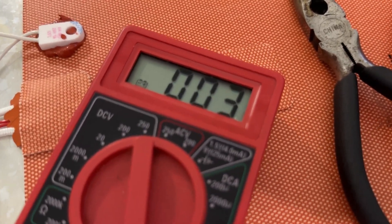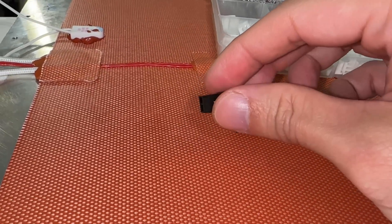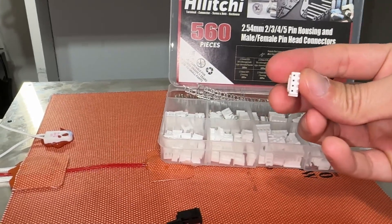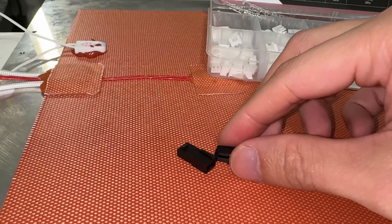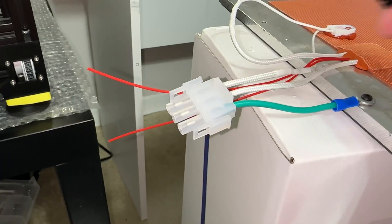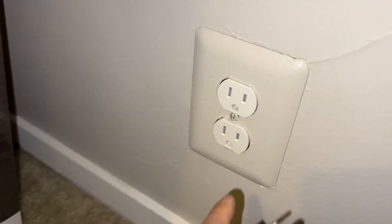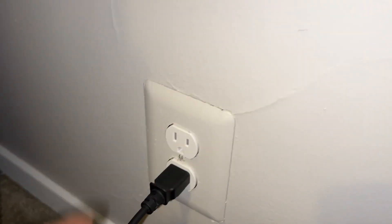For the bed thermistor wires, I will use a microfit connector. Some consider these optional since popular control boards use cheaper JST style connectors. However, the microfits have a better build quality and a higher 5 amp rating. They are also used for inline connections as there is no JST equivalent in the kit, unless you solder. If you don't know which connector to use, the female plug provides power to the male plug, like the one attached to the heater. Still confused? Just compare with a wall outlet — the female receptacle provides power to male plugs.